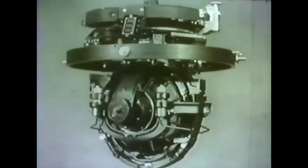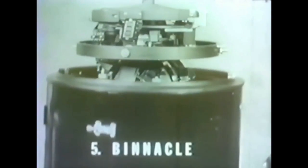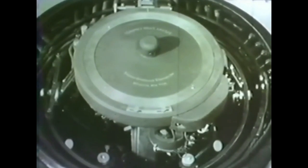This is the complete master compass, ready to be installed in the binnacle, the fifth major assembly. The spider has two trunnions which carry the entire weight of the master compass. These trunnions are supported in thwartship bearings in the gimbal ring, which in turn is mounted in fore-and-aft bearings inside the binnacle. This mounting permits the compass to remain upright, regardless of the rolling and pitching of the ship.